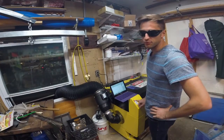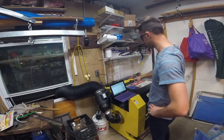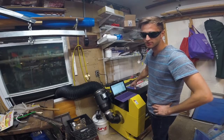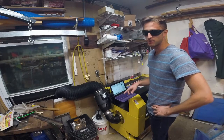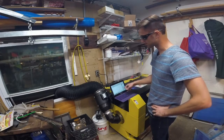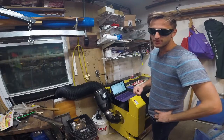What I do before running the laser for real is I take my material, load it in, move my head to the correct starting position that I want, and then just do a dry run to see whether I'm going to hit any problems. Usually I'll send it to start, stop it, and then do a frame to make sure that I'm going to be in my correct location.